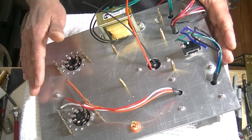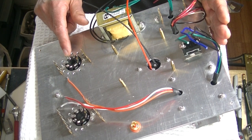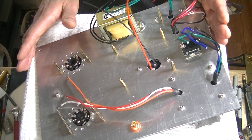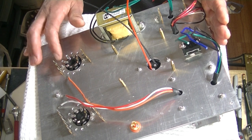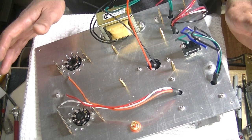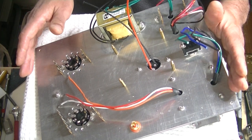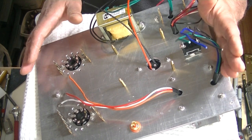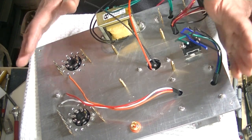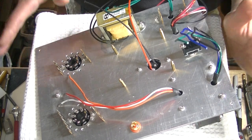This week I hope to have this wired up and testing a stereo set — a pair of monoblocks. I'm going to make a little bias change on the preamp driver tube, which is essentially a 6J5. The biasing was wrong on the prototype — it sounded fabulous, but I think it could sound even better. That's the big problem with designing and building your own gear: they're never really finished. But at some point when this goes to market, I've got to decide it's as good as I can make it. And this is going to be point-to-point wiring, with just a PCB for the power supply.